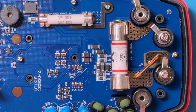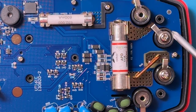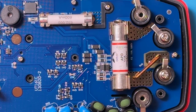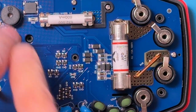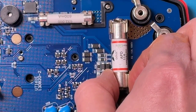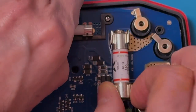Now, just in case you're wondering, there are a fair number of screws to remove in order to get the board out. And of special interest, there are screws on the base of the input jacks here that have to be removed as well, because of the new jack design that they've used here — this fastens the circuit board to the jacks. So those screws have to come out, and then there are a variety of little screws all around. Once all the screws are out, it just lifts out without too much trouble.